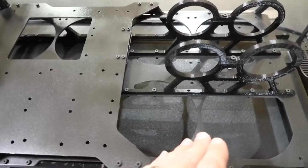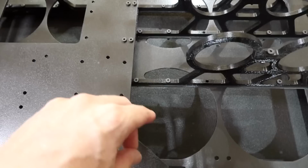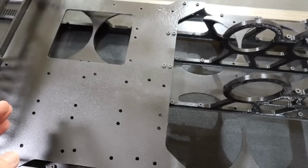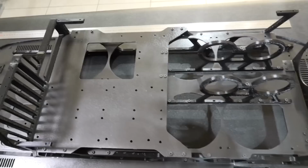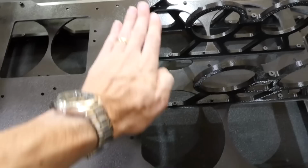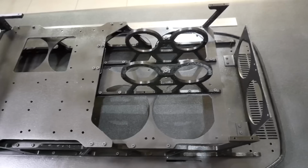Out of the pumps, you can go down or you can stay on top. But there's actually going to be 4 holes in the shroud for the loops. One here, here, here, and here. For dual loops to come up from the bottom to go into the graphics cards and back out, and into the motherboard section or CPU and back out. And what this does, instead of having these huge long runs of tube connecting to a carbon fiber shroud, is going to give the loop a lot more strength, because it means that you have a structural component here that the loop's attached to. So that was important. We didn't want tubing lengths that were going to be too long.